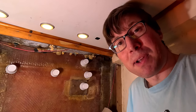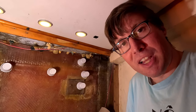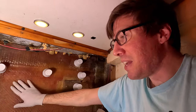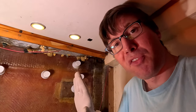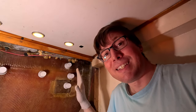Before we put the actual first layer of glass on, we're going to put a thickened layer of polyester resin over everything — we'll add some filler to it so any little voids will be sealed. Then it'll be a nice wet surface to put our first layer of chop strand mat on and start building up from there. The important thing is we're going to work quick — we have to get all these layers on pronto so it can cure as one single solid piece and be as strong as possible.